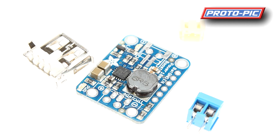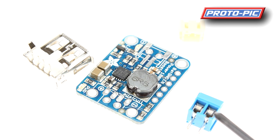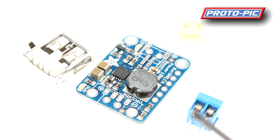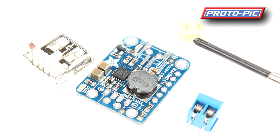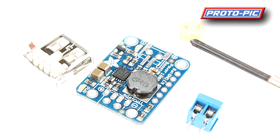It's based around a TPS61030 chip from Texas Instruments, and most of the control lines have been broken out on the board. Refer to the datasheet for what each line does — for instance, you have an enable line you can tie to ground to turn it off, and a low battery indicator that could feed back to your project. The board is supplied with headers including a USB header and pin headers or screw terminal connections. There's also a JST connector for LiPo batteries, which will boost up and give you the full 1 amp at 5.2 volts without any problem.